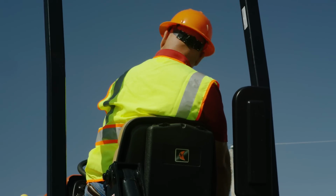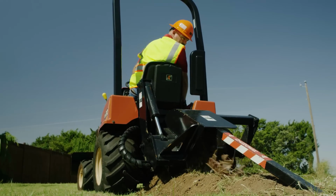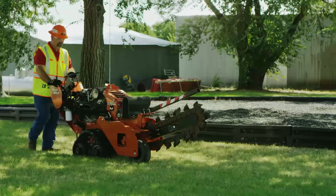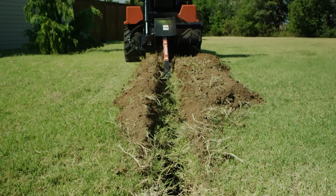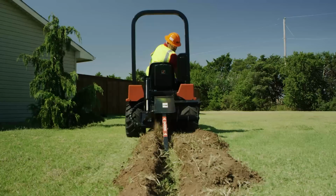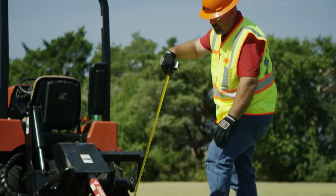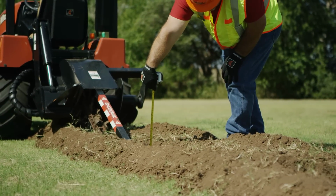Look in the direction of travel periodically to a sight or string to ensure the trench is staying on target. Do not drive in the trench. When trenching or getting the trencher into position, avoid making sharp turns. To avoid wheel slip while trenching, try to match the required ground speed with the soil conditions, using only enough to move the machine ahead with each rotation of the tire. Always stop trenching to make trench observations, such as trench depth.